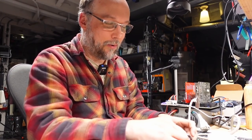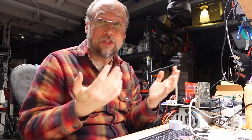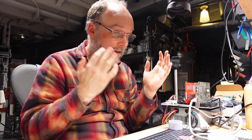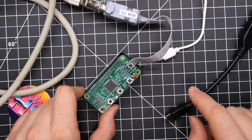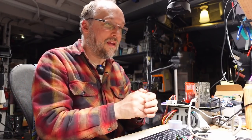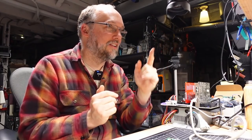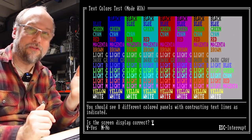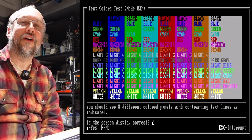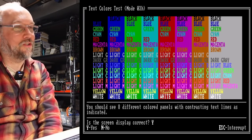You know, it was in a recent video where I talked about how it's really important to double check that there is no problem with the capture setup, so you don't go down chasing the wrong thing. I could have easily thought something was wrong with the CPLD when I think I actually did the repair correctly. I'm going to stop the capture, reset OBS and my capture device, and I'll be right back. And we're back — take a look at that. We have a perfect CGA 16 color image. I did not break it, and all those crazy colors were due to my capture setup.